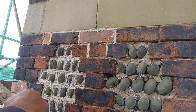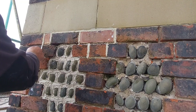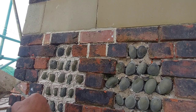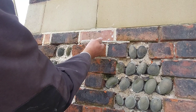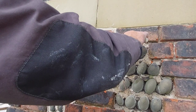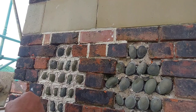This church belfry has had a lot of cement pointing done on it in the past, before the days of when people realised that it was bad. And of course it's eroded a lot of the brick faces. And the stuff that's been used is absolutely rock hard. I mean, I'm using an air chisel to remove it, that's how hard it is. If I have my way, the lot would come out and the repoint would be lime, but unfortunately I don't think the bishop has got the pennies to do that, or the diocese, as it possibly is. I think the vicar would love to see it all done as well. I believe that some of his previous churches have been medieval and undergone vast restoration, so he's extremely interested in this kind of thing.